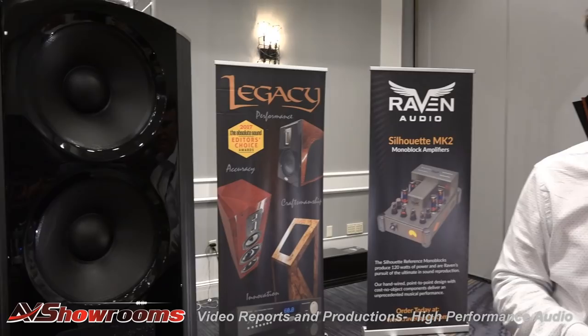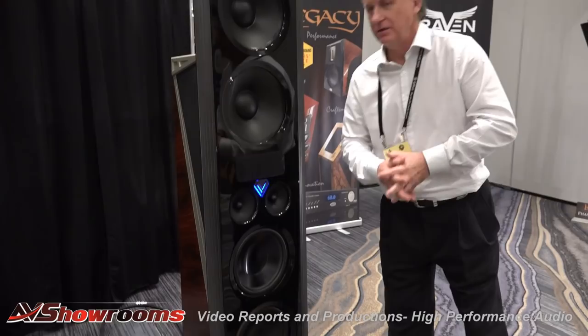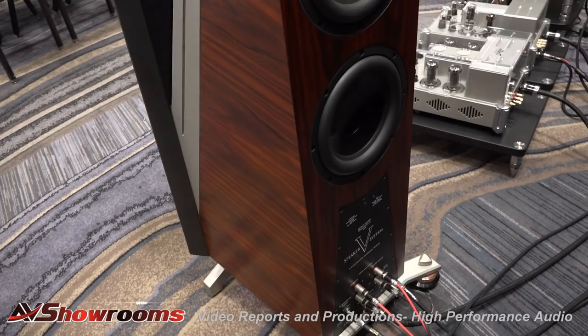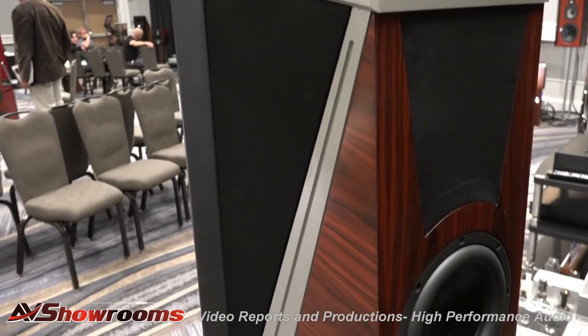And the woofer section on it is dual specialized woofers, one in a sealed mid bass capacity, and one in a subwoofer capacity. On the rear, there are passive radiators that you can see. The speaker is quad amplified, and you can get as many channels as you want internal, or you can leave it to drive totally externally if you like. In this particular case, we're using a couple tube amplifiers for the top end of the speaker, and it works out great.